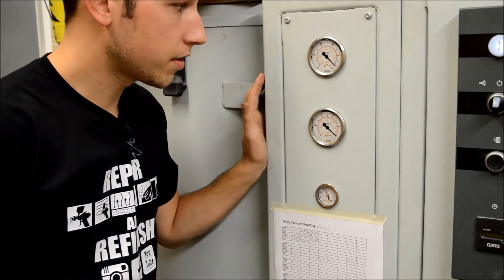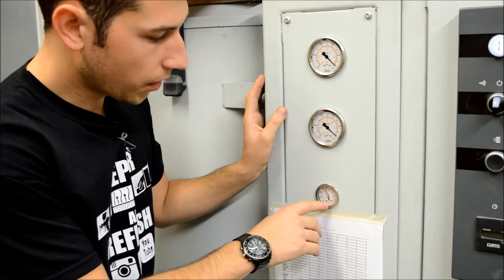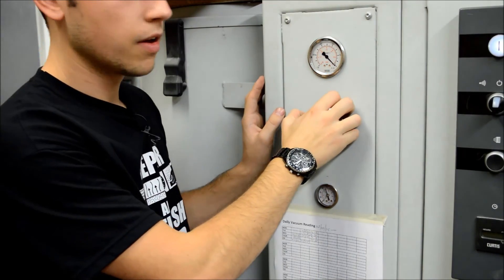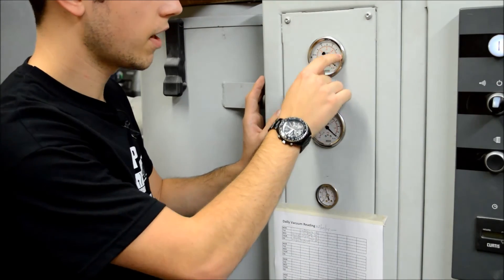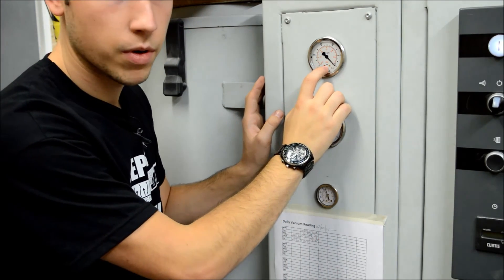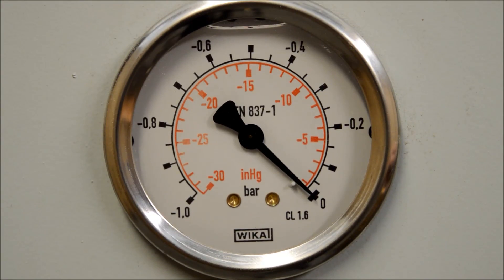The last thing we're going to look at on this extraction unit are these pressure gauges. The first one is for the air inlet - this is the pressure going into the actual machine. As you can see we've got the black one on the outside measured in PSI and the red one on the inside measured in bar. We've also got the airflow gauges which measure the pressure of how much the extraction is sucking through all the pods throughout all the workshops. On this gauge the outside black is measured in bar, and the inside red is measured in inches of mercury - some of you will know that measurement from the barometer. We'll power it up now, do a close-up of the pressure gauges, and you'll see them moving and adjusting to make sure the airflow is constant.